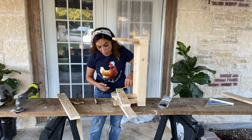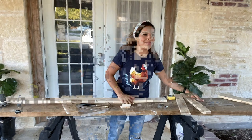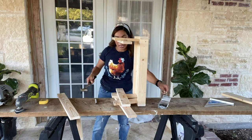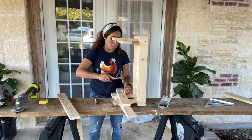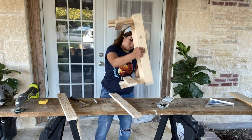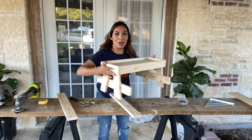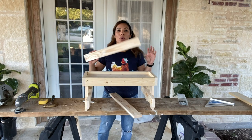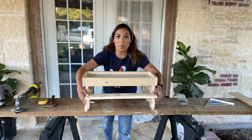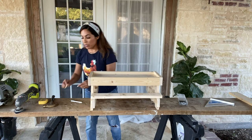I can see a light at the end of the tunnel! From the bottom of the leg, measure two inches and make a line. Then measure from the inside of the first leg to the outside of the wood — you want it to be five and seven-eighths inches. Go ahead and nail these in — I'm doing two nails, one on top and one on the bottom in the middle. And there you have it, ain't she a beaut! Now take your 20-inch seats — your one-by-threes — and nail them on top of the support beam.